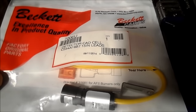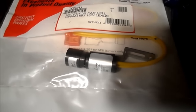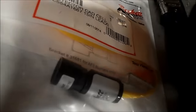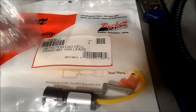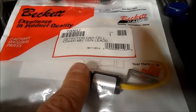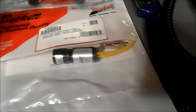The reason I say this is just from experience - the burner is lighting and firing, fuel is present, everything is good. I bought a replacement CAD cell just for testing. The one in there has been cleaned, and I have a TV that uses a similar CDS cell. I'm going to take some resistance readings of the one that's in there and compare with the new one. I'll replace it anyway, but I don't think it's bad - I think there's a cold solder joint in that button.